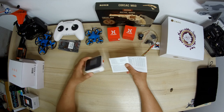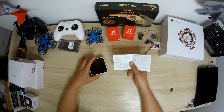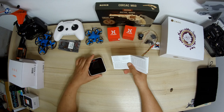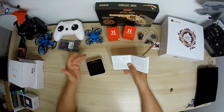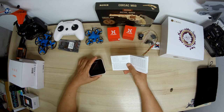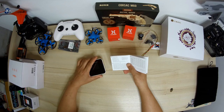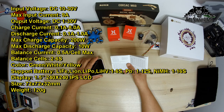There's a lot of charging current to set. When it comes to setting the charging current, make sure you know whether your battery can take it or not — otherwise you will have an explosion and a big fire. Always set the charging current carefully. Normally 1A is more than enough to charge but it takes time. If you know your battery's charging capacity and what currents it supports, you can set it higher. Max charging power is 200 watts. Discharging current is 0 to 1A only, and max discharging power is 10 watts.